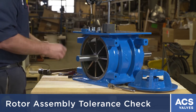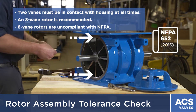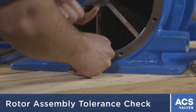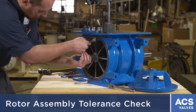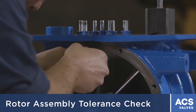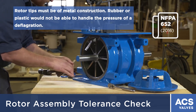After you do that, take your feeler gauges. To stay compliant, at least two rotor vanes must be in contact with each side of the valve housing at all times. We recommend valves with eight vanes, as anything lower than that would be non-compliant. Stick the feeler gauge under the rotor blade to the housing, and to the top of the housing to the rotor blade, until you feel friction on both feeler gauges. Rotor tips must be of metal construction — rubber or plastic would not be able to handle the pressure of a deflagration.